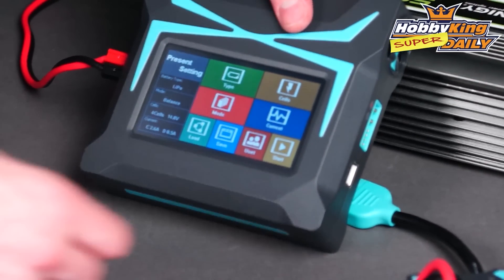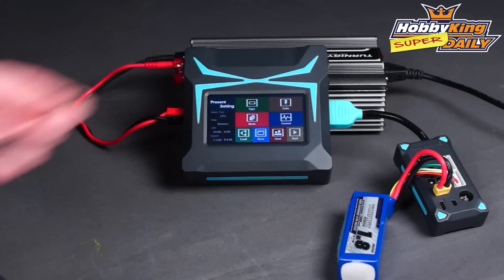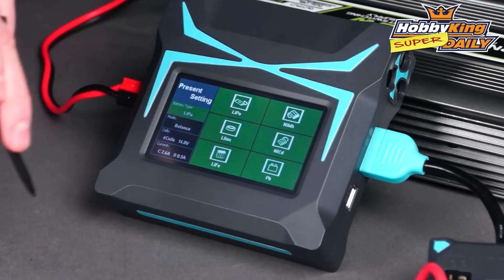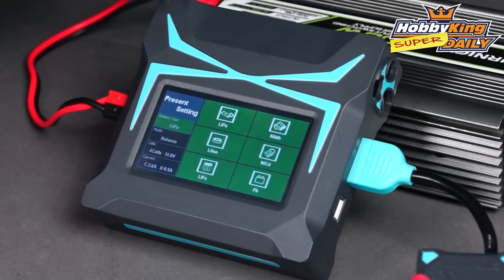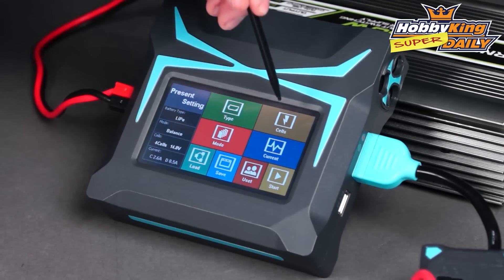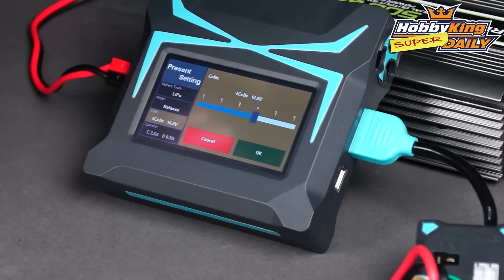So I'm going to go ahead and plug the board in here. You can see that it's very, very neat and tidy — that just simply plugs straight in there. Now with this plugged in, we can go through the demonstration of the balance charge process. This is a lipo battery, so I simply select type. You see the different options: nickel metal hydride, NiCAD, lead acid, LiFe, lithium ion, and lipo — a great deal of choices. Click on lipo, and you'll see in the bar at the side it displays the setting parameters you've selected.